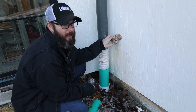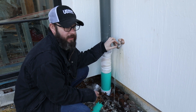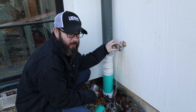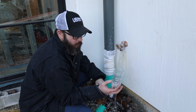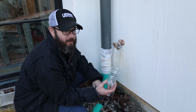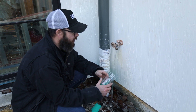Now that we've got the carbon filters online, we've got our standard pump program at 60 seconds, 100%. We're going to test, just run in some water now, and then here in a moment we'll grab a sample of water. What we're going to look for is bubbles in the water — we've got it outlined in the manual as the bubble method. You're just looking for free oxygen past the injection point.